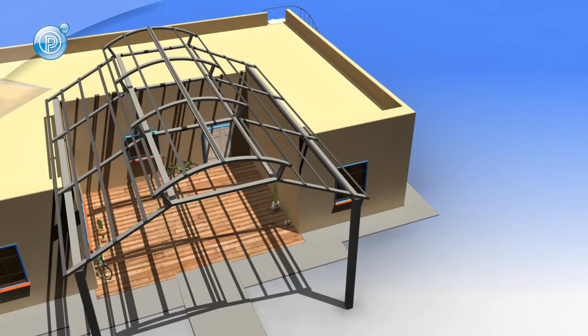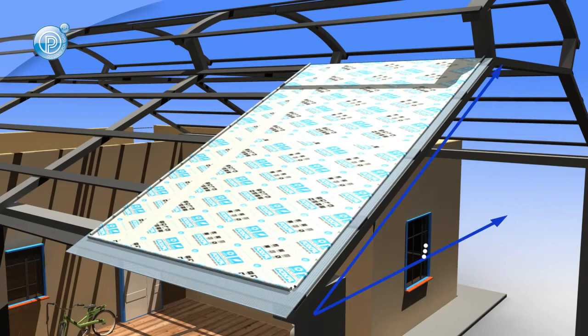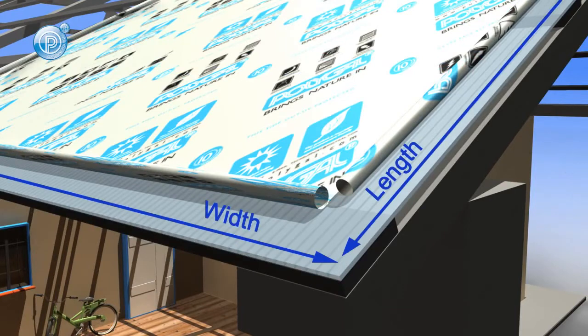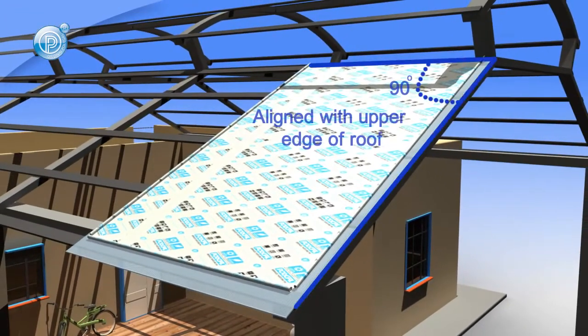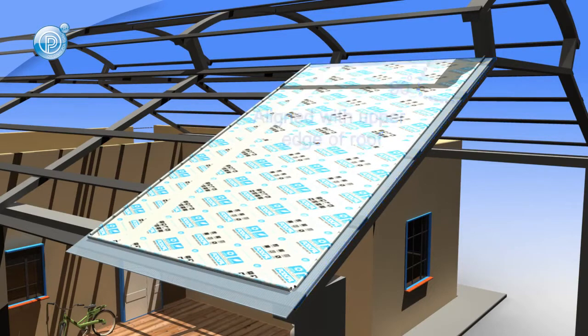When installing Polygal as a roof or canopy system, be sure that your minimum slope is at least 10%. During installation, make absolutely sure the sheet flutes go in the direction of the slope for proper drainage and moisture evaporation. Once installation has begun, ensure proper alignment and placement for subsequent sheets and profiles. Keep in mind that the lower edge of the sheet should project slightly over the edge of the lower joist.